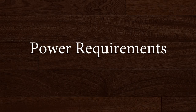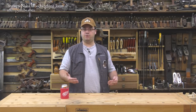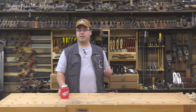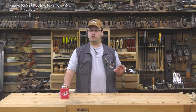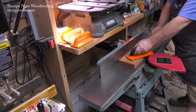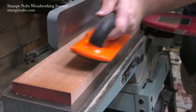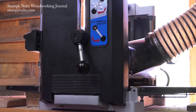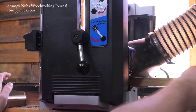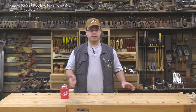Another thing we previously considered was how a helical cutter head requires more power than a standard one, because the cutters are constantly in contact with the wood. After two years I can say this has been noticeable — I have to take shallower cuts than I did with my straight knives. It hasn't been a big deal unless I have a lot of lumber to mill, in which case it does add some extra time. This wouldn't be a problem with a bigger professional-grade machine, but with small shop machines like many of you have, it's going to add to your time if you're milling a lot of wood. If you're just milling two or three boards, not a big deal at all.